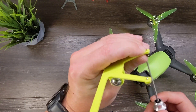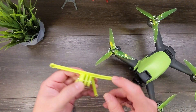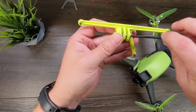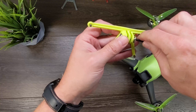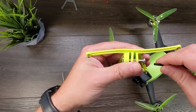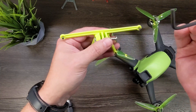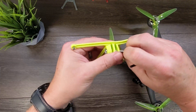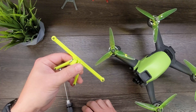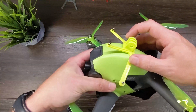Now that we've got the last one started, we can go ahead and start the installation on the drone. One thing you might find is it may be easier to remove this bolt — we have this pre-installed — just go ahead and remove the bolt through the hole there. This will allow it to flex a little bit more while you're installing it. Go ahead and use the wrench that we provide and remove that.